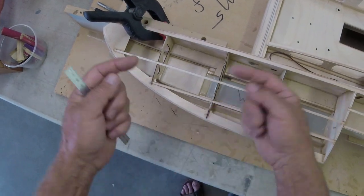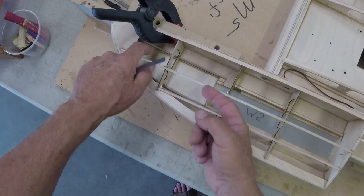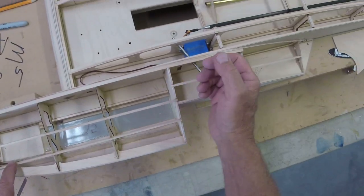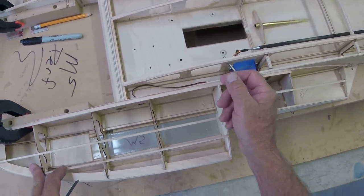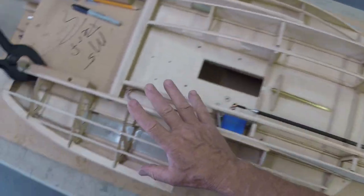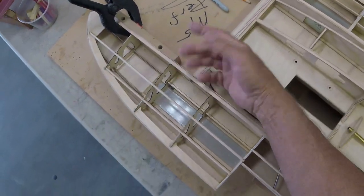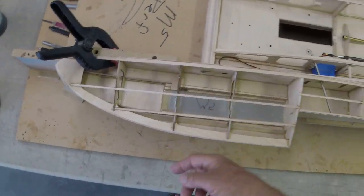So we're putting foam in, backing all the way up. Pour foam will give you strength. Yes, it'll add a little bit of weight. This boat is super light. It's going to be flighty. I'm sorry, it is. It's got all this surface area here and none back here. A little bit of weight up here isn't going to kill us, man. Don't put a whole ton in here. Go watch the video. It'll show you how to do it.